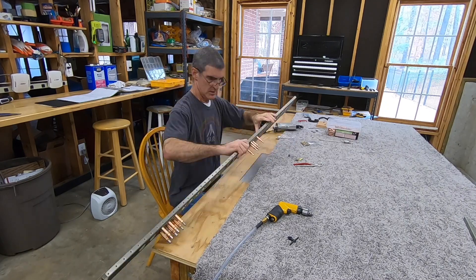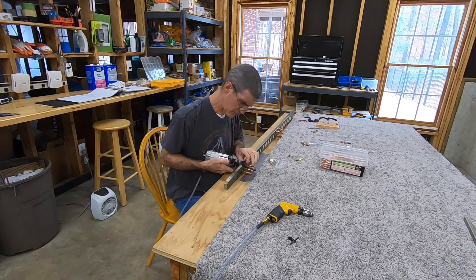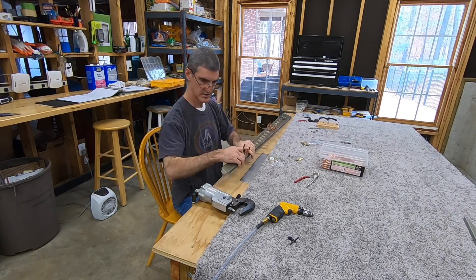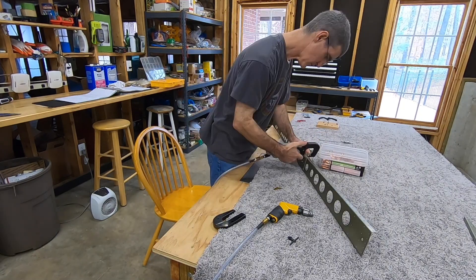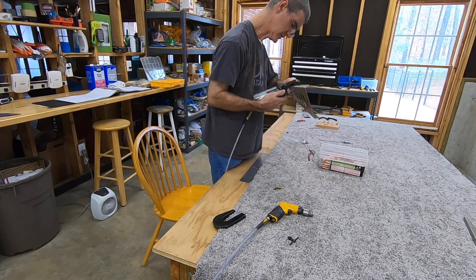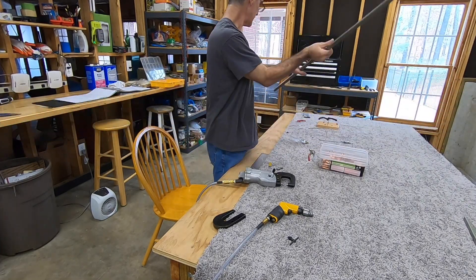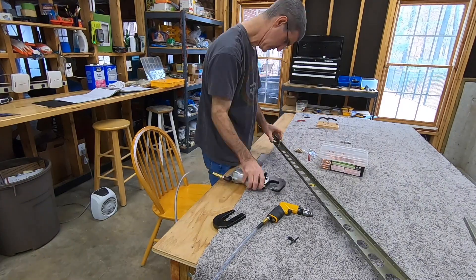These next steps were really simple. Here I go ahead and attach both of the reinforcement plates to the spar, and then come back and attach the nut plates to the reinforcement plates and the spar. I did the same thing with these nut plates that I did with the one in the control horn — I used the tie rod end to hold it in place and then riveted. That's it for steps one through four on page 7-7 of the rudder.